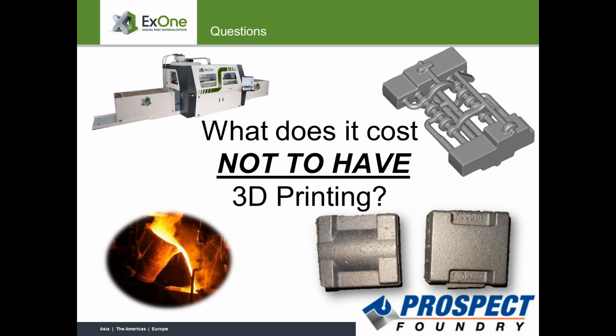The GFN, or grain fineness, that we use for these particular cores was 83 GFN silica sand with the furan binder. And as far as the core size, the S-Max 3D printers that we have at our ExOne adoption centers, both in the Detroit area and also the Houston area, are capable of printing 70 inches by 39 by 27 inch build chambers. So basically as one piece, it would be 70 inches in length.